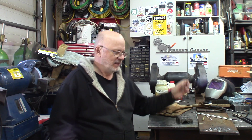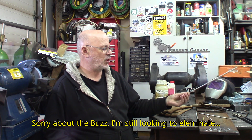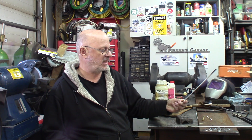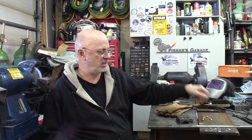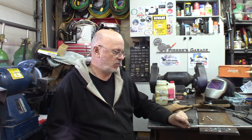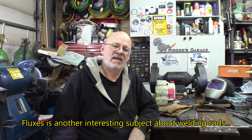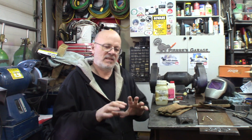I decided, just for the fun of it, to try some 1/8-inch (3.2mm) 7018 and some 6010 welding rod — this is 5/32-inch size. I have some 5/32 of the 7018 but I don't want to open the box just to take a few rods and unseal it. These rods are meant for very different purposes. The 7018 is very sensitive to humidity, and if you want to weld with inspected welds these have to be kept in a warm environment without humidity changing the properties.